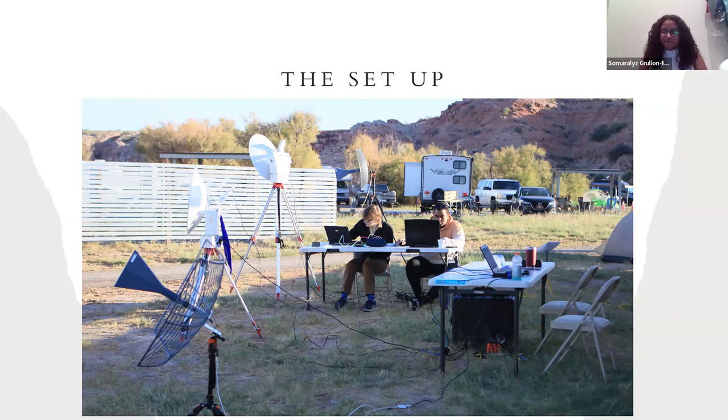Okay, thank you. One thing I'll note: even though those use spread spectrum technologies for the Ubiquities and such, interference is still possible. Something we didn't really try, even with our setup at Iowa State, is that you can manually set what the channels are for those. If you have two that are really close to each other, I'd probably shift one to a different bank of channels and the other on the farther side of the spectrum, just to avoid any potential interference between the two. That'd be something else you could try for next time. Definitely — thank you so much.